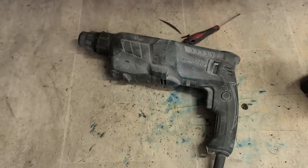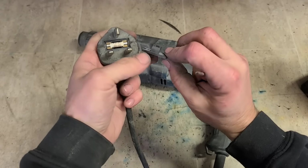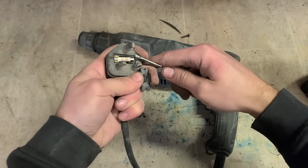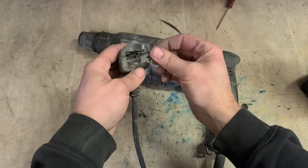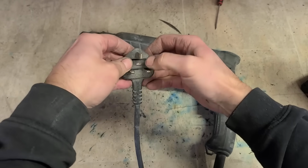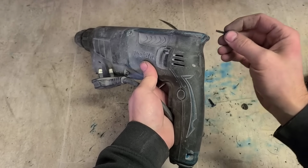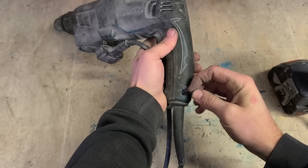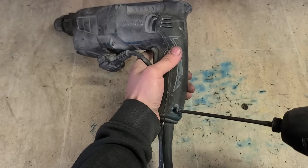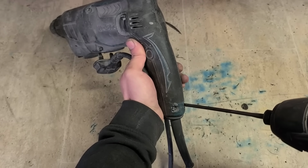Amazing. Doesn't often happen, but it still does happen the odd time. Somebody's sending a machine that just needs a fuse. Is that not closing now, look? It's better. Right. Obviously somebody tried to change it. You just assume everybody can change a fuse. This man can, but he fitted a 1 amp fuse, which ain't big enough for something like this.